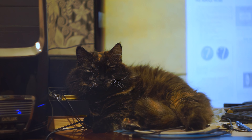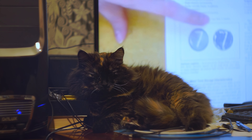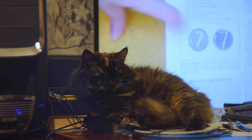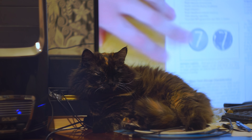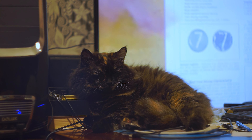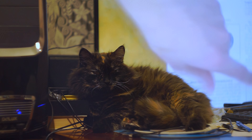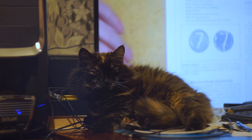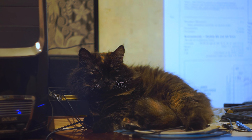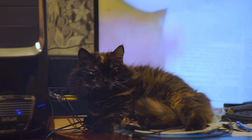Right at the start in their brochure, they're showcasing the advantages of the NIMO over the Nixie tube — the cloudiness of the image, although in practice the NIMO does have its own artifacts with reflectance and refraction. 'Refractance' is not a word, but it should be, because there is reflectance so I guess there should be refractance. And here, the side viewing angle — which I just showed — you can view it from a side angle, which is very true.